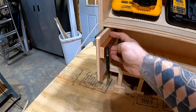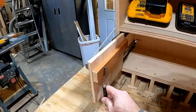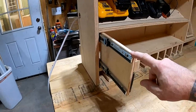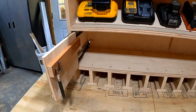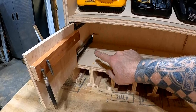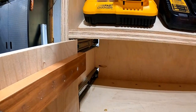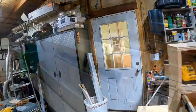The little thing that I did off site there is I put a little magnetic strip here for my bits and tips and that kind of stuff. It is on two 10 inch drawer guides. And to be honest with you, I kind of screwed up when I cut this. This is actually 9 1/4 deep. These are 10 inch deep. So I had to cut out holes in the back underneath there for both of those drawer guides to stick out. So yeah, I screwed up.